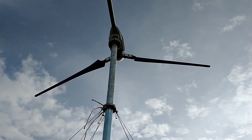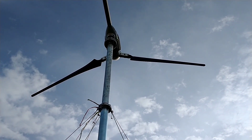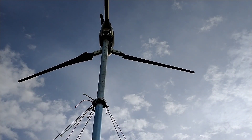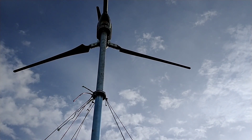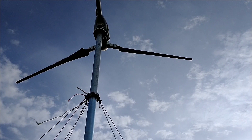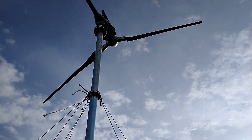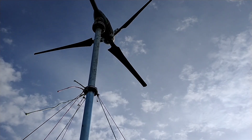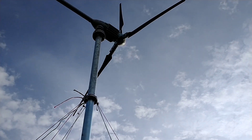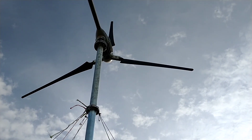We've got light winds, it's nearly starting up. We're going to take it down and put the five-blade prop on because that will start up at a lot lower wind speed. At the moment the wind is really — you can feel it in your face — probably around that 10 mile an hour. There's a bit of a gust now, it's switching. We just hope that we can get a bit more low wind output.